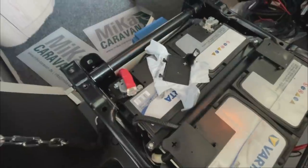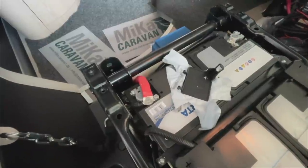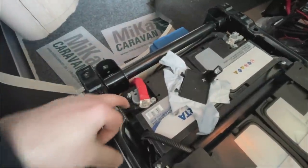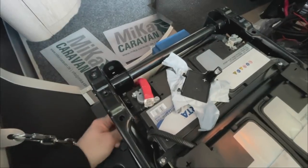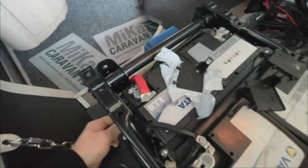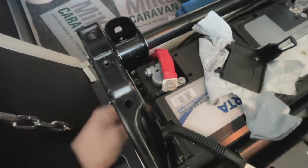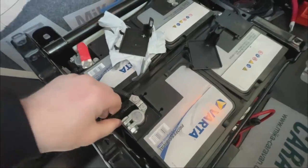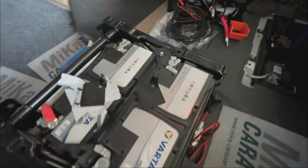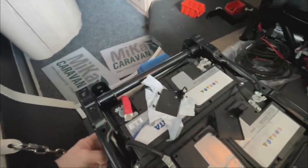I don't know. I won't say much more about it. This is how they connected the inverter – these are the cables from the inverter, the thick ones – and here they did it like this: just look at this, it just comes together like that. When I see this now – it's not meant as scolding – but look, the whole cable is loose. Here everything is a catastrophe. Let's not look any further, doesn't matter. But installing it like this is already totally fatal. Error number one. Error number two.